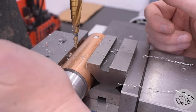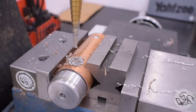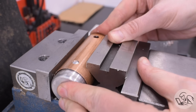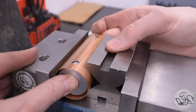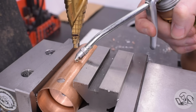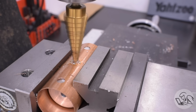transferred my sacrificial mandrel thing to the other side, and drilled the same hole. The mandrel kind of self-aligns on the step drill once it gets close. You can kind of eyeball the clearance cut that was made on the first hole, and then push it down to the middle, eyeballing it roughly again under my dimple there. Again, if your hole is anywhere close to the step drill's new location, it will self-align with extreme prejudice once it gets through the material.